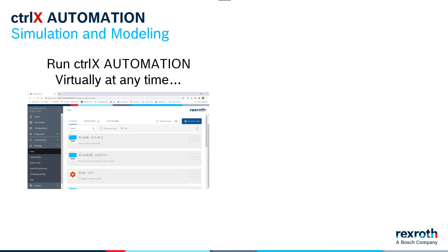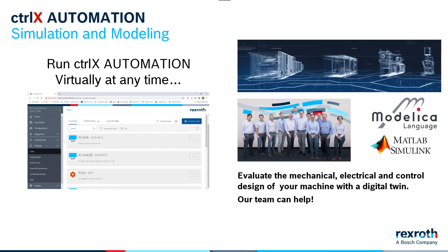Another feature of this type of app architecture is that it becomes very easy to simulate it virtually. In fact, you can test all your code at any time on your PC with a ControlX Virtual Core, even simulating motion feedback from servo drives. This helps you to verify machine operation before the machine is actually built and speeds up commissioning once the machine is up and running. ControlX Automation also has connections into popular simulation languages and platforms that help you test designs before you even start cutting metal.